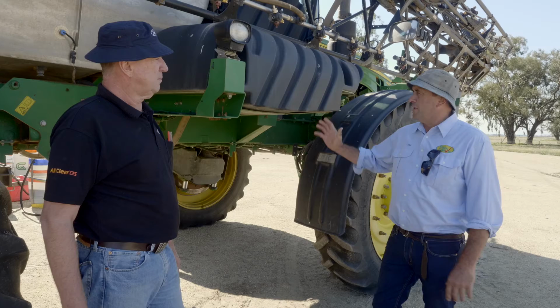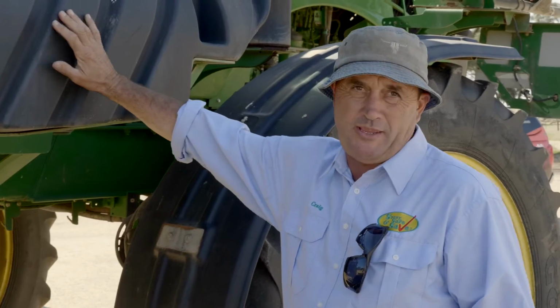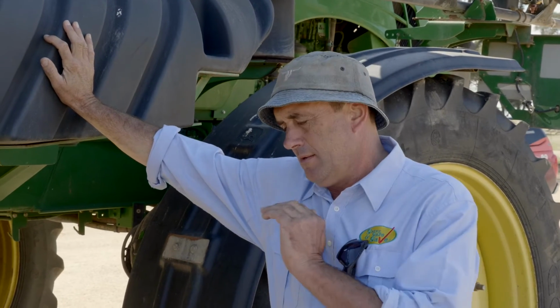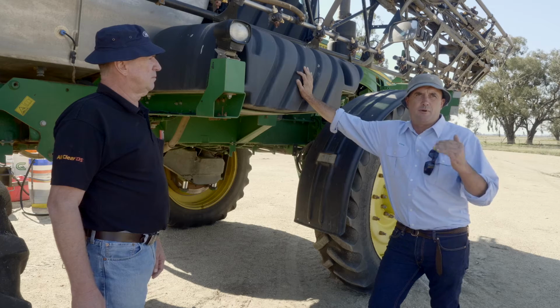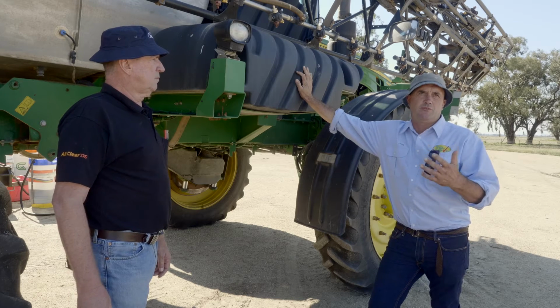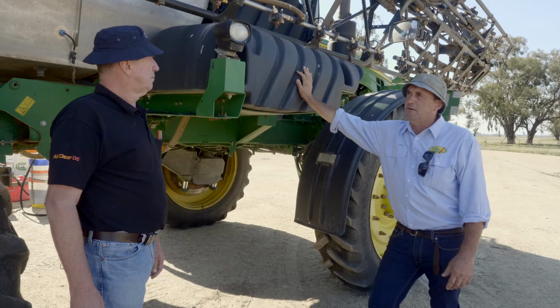For me, one of the most important things that growers can do is in the field, make use of the freshwater tank. Before you come back to where you do your cleaning out, try and pull this freshwater tank in 3 bites. That will basically triple rinse the machine, leave the bulk of the residue in the paddock, so you can then come back and start that cleaning process.